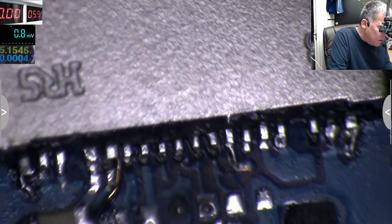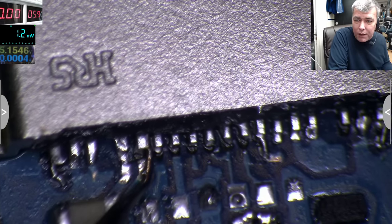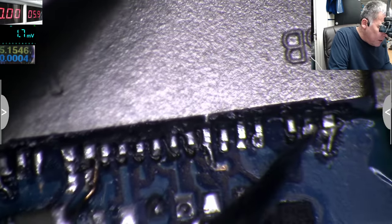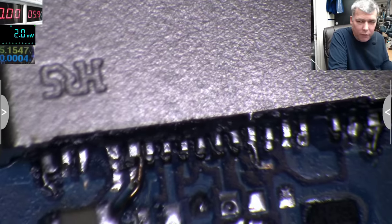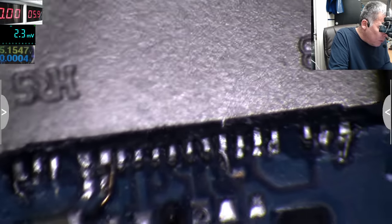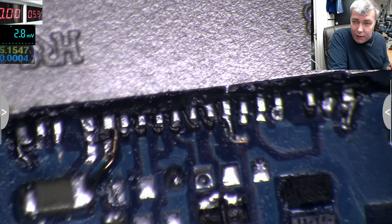Pay attention to plus and minus — these are the first things you have to restore. You have two plus pins together to carry more current, and one plus pin here — so three plus pins total. For minus: three to four minus pins to carry more current. Then you have ground pins — one pin here, two pins here. You need to restore at least two of each. It might work with one each but things will get hot — you're carrying around 1.7 to 1.8 amps.